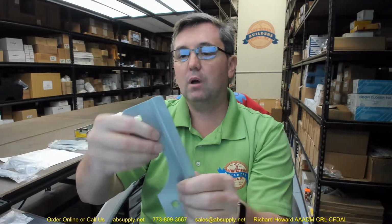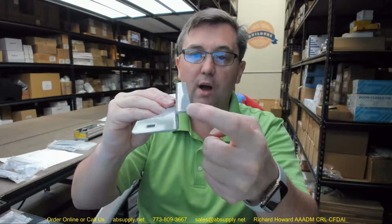And this is a model that features an inset like this, or would permit a door. They call it offset because this is certainly offset, but it's there to permit an inset of a door where it's inset into the frame deeper than standard, or it's offset to account for some sort of applied thick material on the outside, extra trim, or a wall condition, some sort of a detail between the frame and the wall that can't be modified to use a standard latch guard.